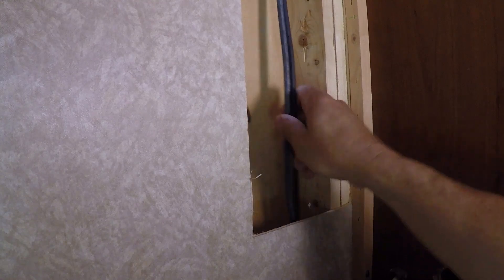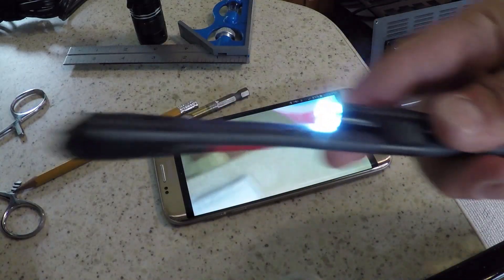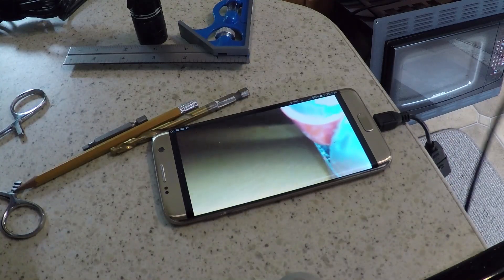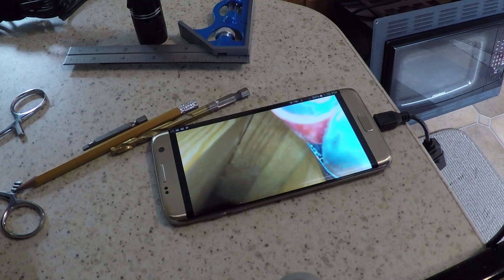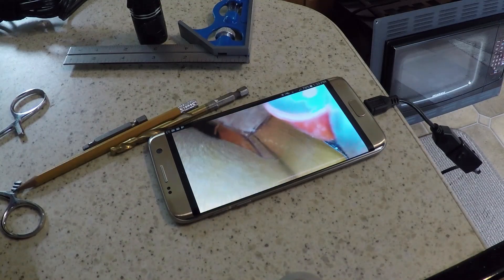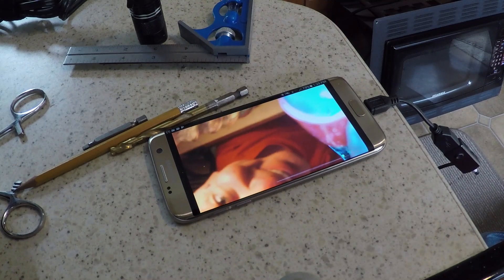It was a bit of a challenge, so I decided to break out my boroscope to help me see better from inside the wall. I taped the end of the boroscope camera toward the end of the cable and used it to navigate my way through around those cross supports all the way to the bottom. A little tip: I put a slight bend in the cable so that when I hit an obstacle, I could rotate the cable to get around it — and eventually I made it out the bottom. To make future pulls easier, when I pulled the scope back I attached a yellow pull wire so next time I can just pull cables through using that.